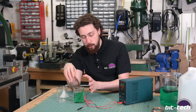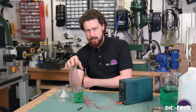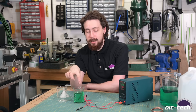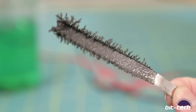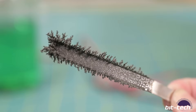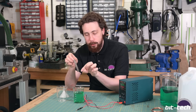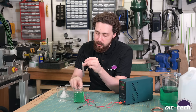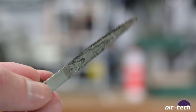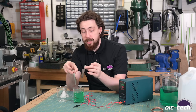I left it for about an hour and as you can see it's gone a really nice deep green colour. The longer you leave it with more nickel going in, the deeper that gets - commercial solutions are a really deep teal, showing how much nickel is in there. You'll get deposits on the cathode - these dendrites of nickel depositing on it are quite fragile and can fall off into the solution. The thin anodes get very eaten away, leaving residue on the bottom, so I found the best way to deal with this is just to filter it out.